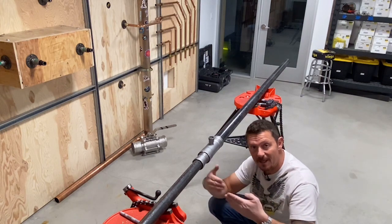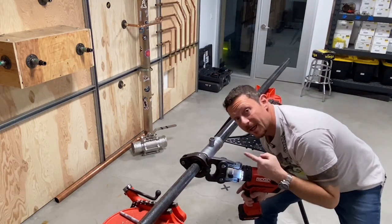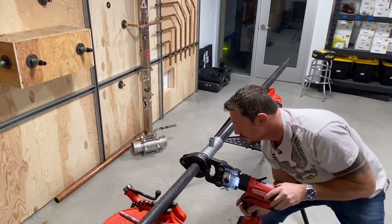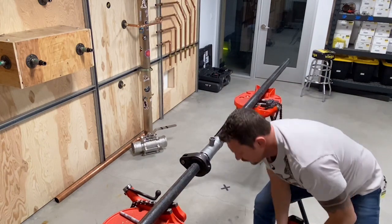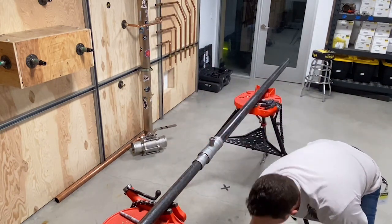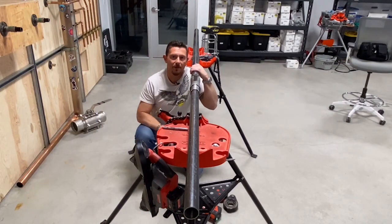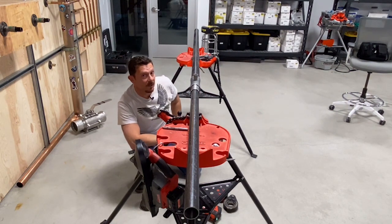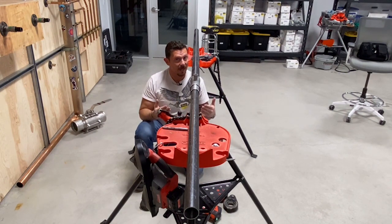In this case it's going to come towards me — that's the opposite of the press I just made. Again, I can apply some force in this direction to counteract some of that pressing force and keep things moving straight. And voilà, we're all pressed up. You can see it's pretty darn straight. You can easily control deflection when you understand which way the fitting will move — the pipe will move in the opposite direction, and by counteracting that force, you can run straight pipe every time.